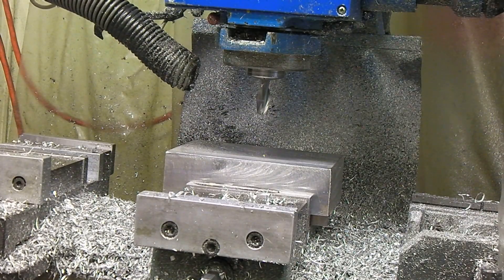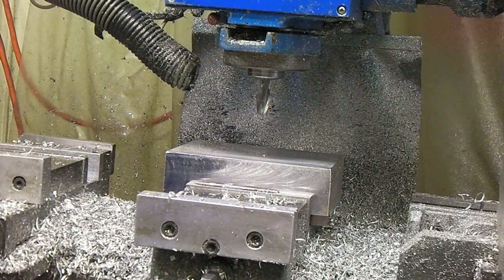The total depth we're removing is 0.44 inches. The first pass I'm going to do at 60 inches per minute, then I'm going to go ahead and overdrive it 100% and see if it'll do 100 inches per minute, which is as fast as everything is set for. It's a 5/8 two-flute carbide cutter — nothing special about it other than carbide. We'll see how this works.